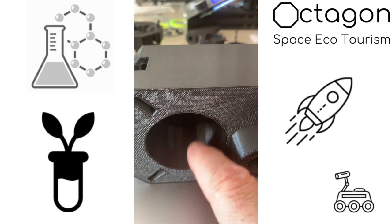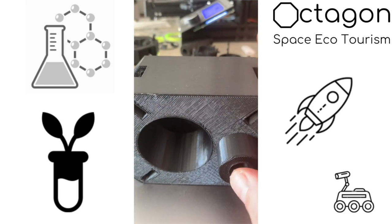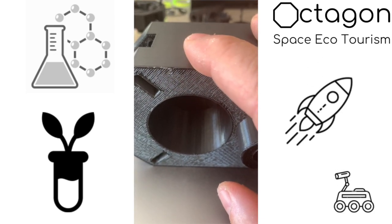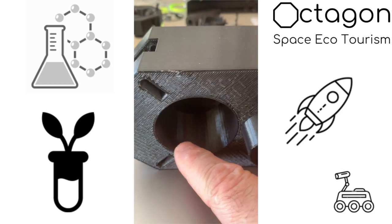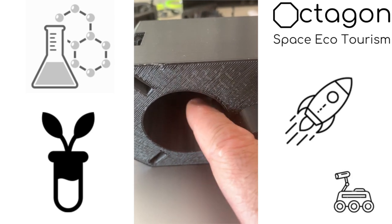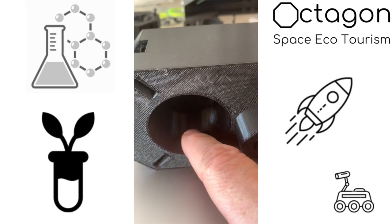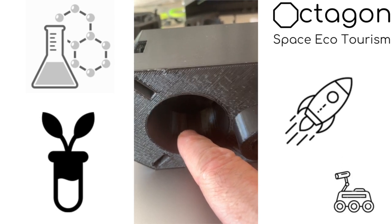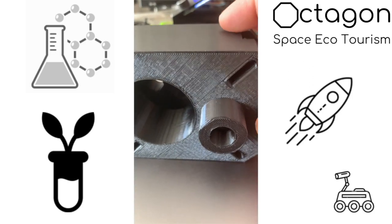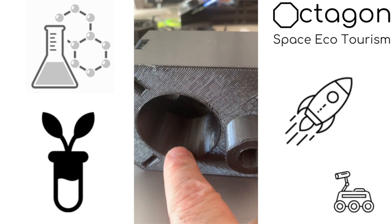And what's going to happen is that everything is going to start melting. Or, very specifically, I think the melting point of TPU is close to 200 degrees Celsius, but it starts to deform, or its elastic temperature is 50 or 60 degrees. And if we run this pump really fast, especially with an electric motor, this is going to heat up. So part of the design, and it's probably best explained with CAD files, is that I actually have cooling built into the wall of this cylinder in this piece.